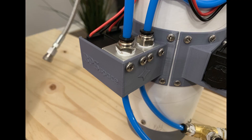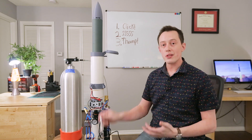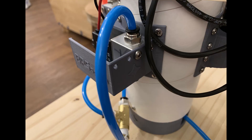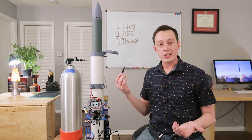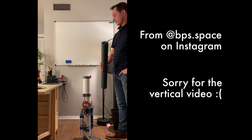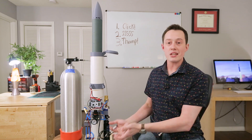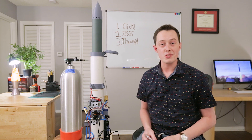After these first valves there's a second set of valves — so we've got an arming set and then a firing set. Once these second set of valves actuate in conjunction with the first, we send all of this pressure — up to 150 PSI — into a big air cylinder right here that actually ejects the rocket. There's also a bleed valve. Its first function is to drain the system of pressure after the vehicle has left the silo. You can actually hear it when the vehicle leaves the tube. We have anywhere between 60 and 150 PSI getting pushed into this cylinder, and there's no way to relieve that pressure until you open the bleed valve.